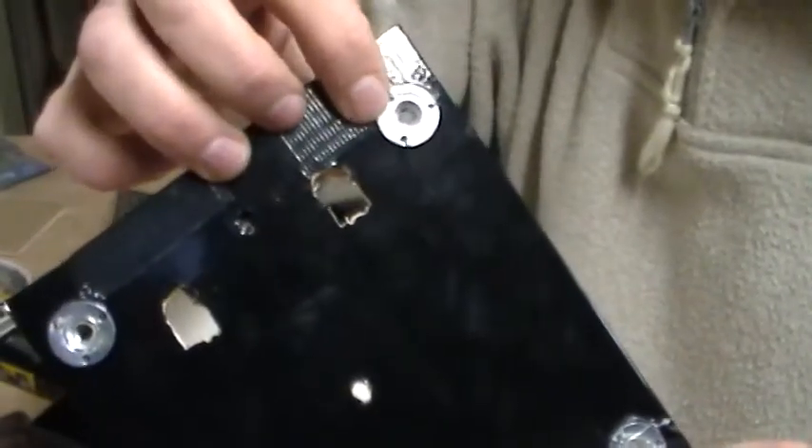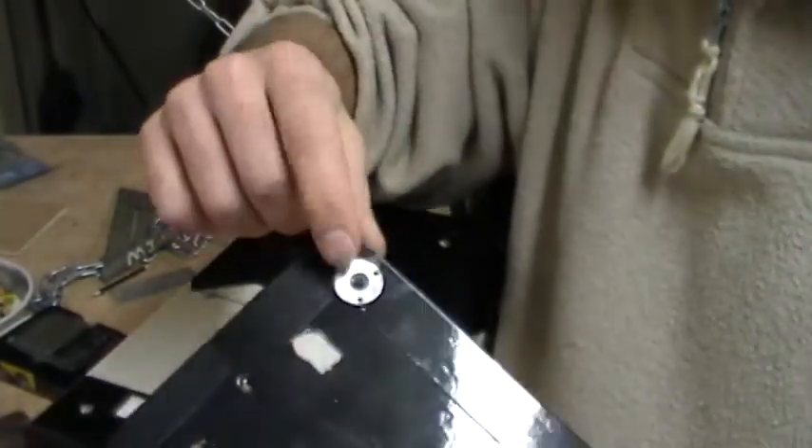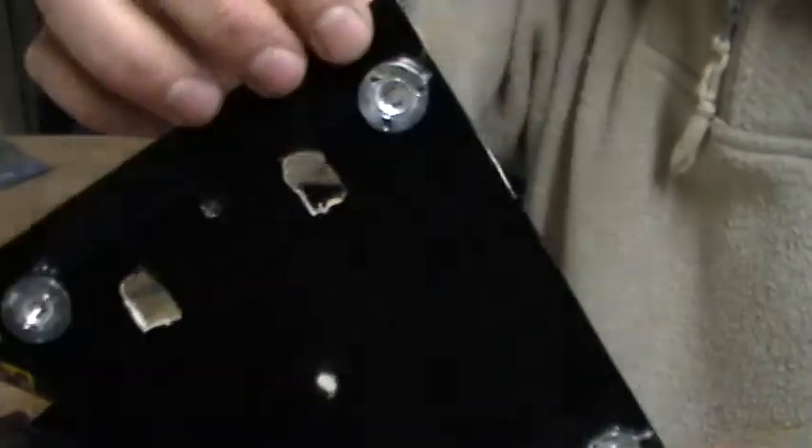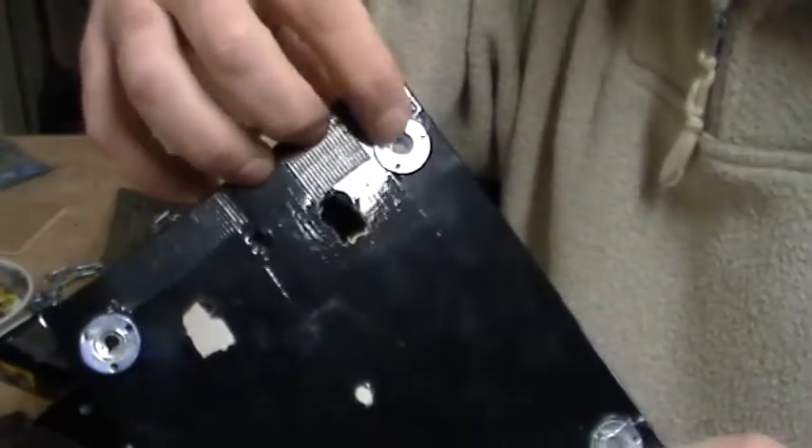There are two different types of blind nuts. There's these round ones with the brad holes. And then there's those other blind nuts that have those spikes that you pound into the wood. I decided to get the ones with the brad holes because I was thinking that the hot glue would come up through that.